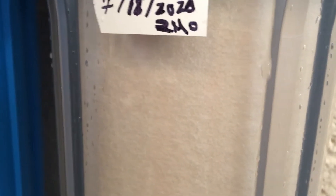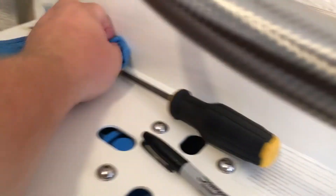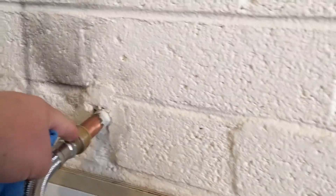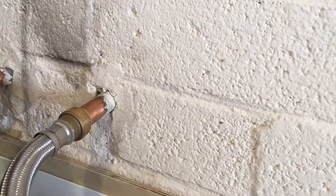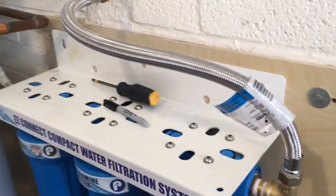My handwriting says '240' but it's supposed to say 'two months.' Seeing the clean housing gives me satisfaction. An easier way to do this whole process is to put a bypass valve — you can put a T on both sides so you can shut off just this section. Our soft water loop goes round and round — it comes in off the street, goes under our slab, and comes in on a three-quarter inch line.